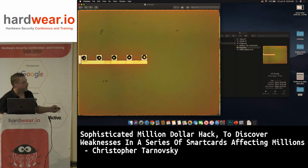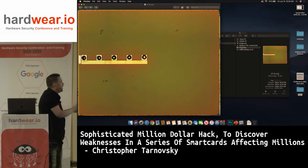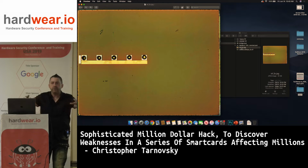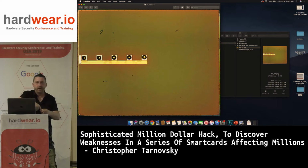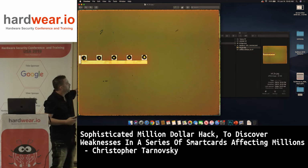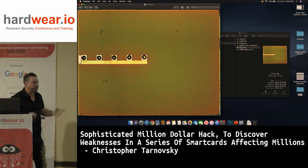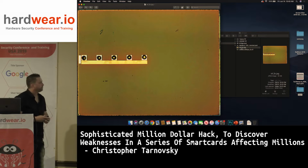But as soon as I put a wire down on any one of these, it's going to smash the original ball. The original ball is going to get smashed and crushed as the new wire gets placed down. You follow me? So which could have damaged the shield. If I damage the shield, the chip's garbage. Throw it away. Get another one.